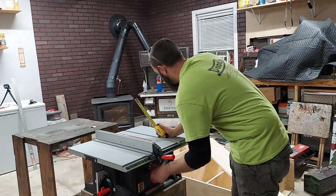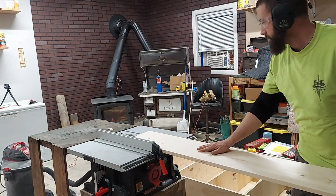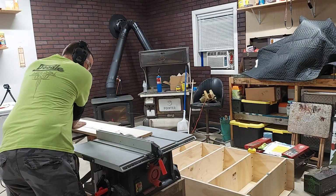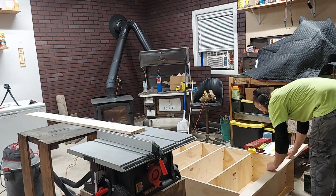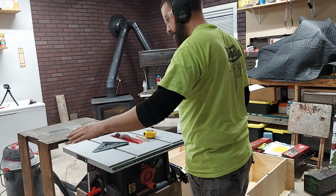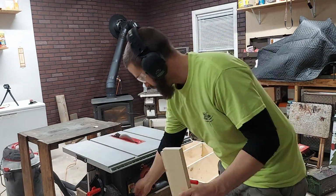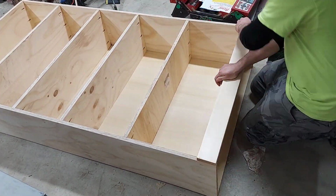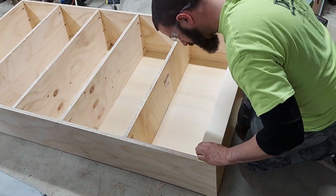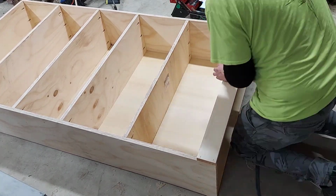And this is my piece of pine that I had, and I'm going to do the whole front of it. I'm going to line this in to hide all the plywood edges. Where people put edge banding on, I wanted to do actual wood to hide that plywood look and to add strength, because a lot of bookshelves you buy are real weak in the shelves and they'll sag. So putting this on is an extra reinforcement also, and it looks good. It hides all that nasty plywood look and makes it a more finished piece, I guess.